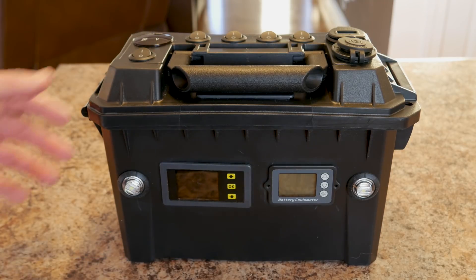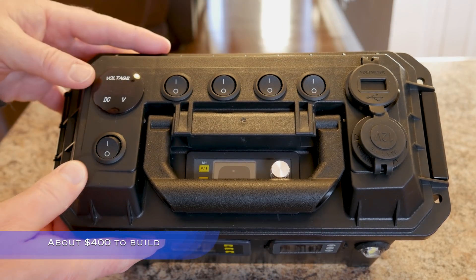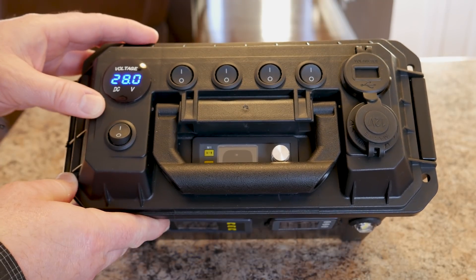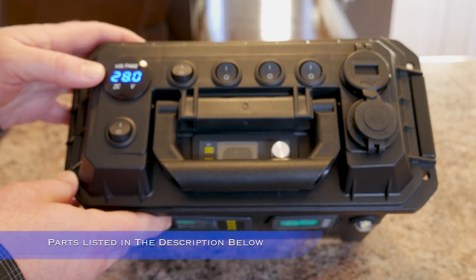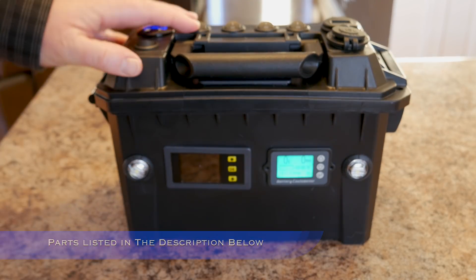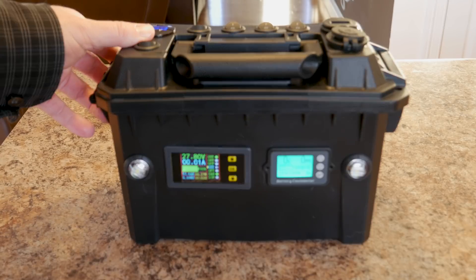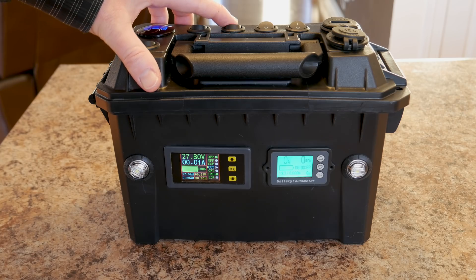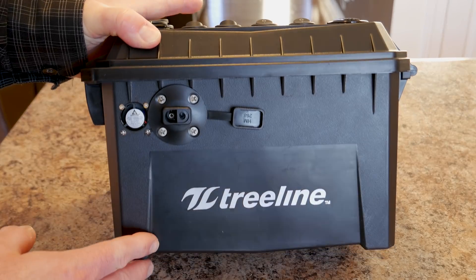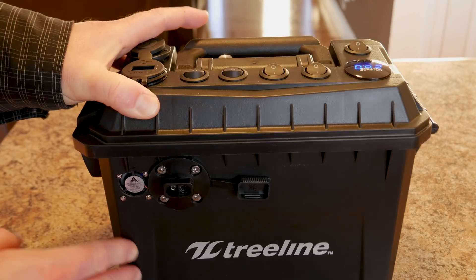I'm really happy how the box turned out. It's laid out really well — it's going to be perfect for charging small devices. An always-on voltmeter provides quick reference for voltage for the system. The first switch powers on the 24-volt relay, which turns on power for the entire system. A relay allows a lower voltage switch to control a higher voltage device — in this case, power from the 24-volt battery. The second switch controls a 25-millimeter fan, which helps exhaust any heat and hot air from the enclosure. I'm quite impressed in how much air this little fan can actually move.